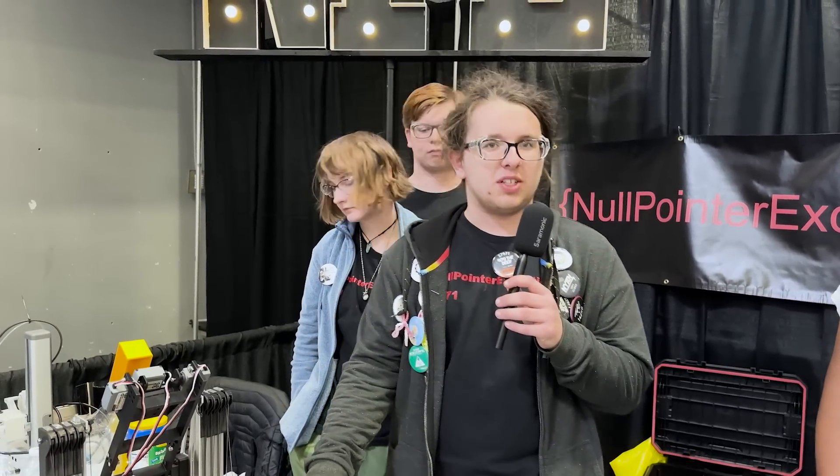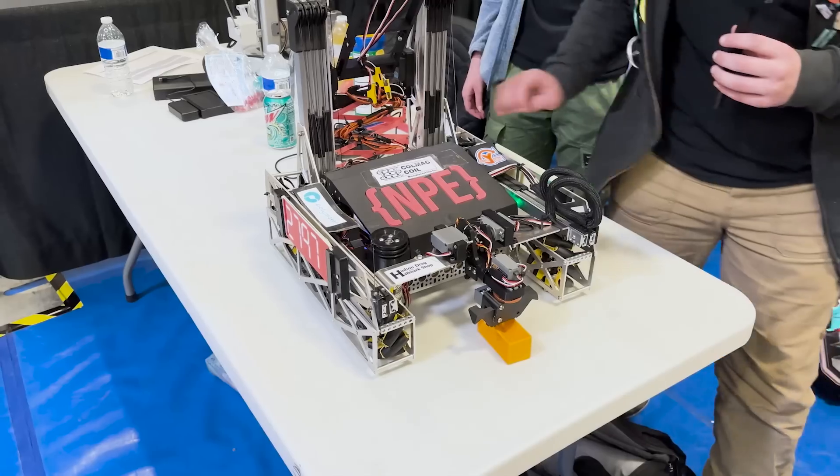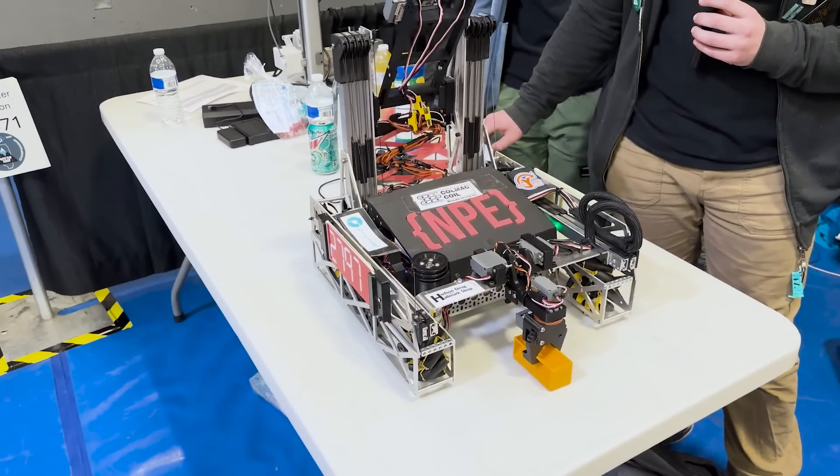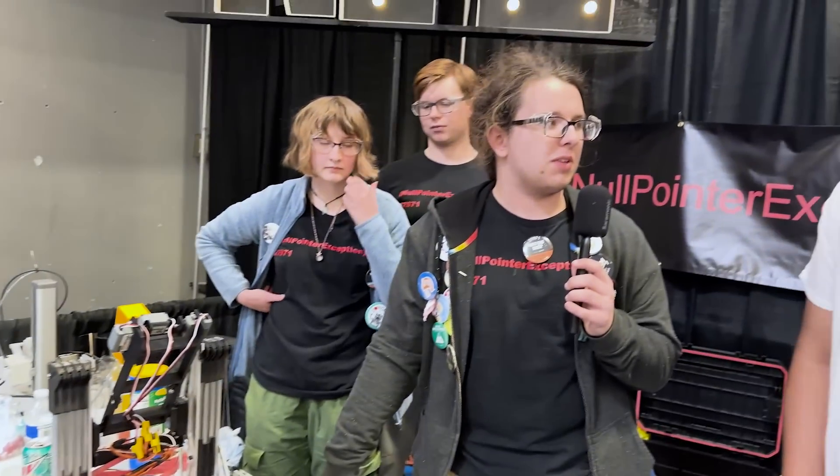Talking more about your outtake — how did you decide on two super-speed servos on each end as opposed to one torque servo? We originally did have torque servos, but they were really slow and we had to wait for them to move during transfer. So we switched to speed servos and got our transfer down to about half a second — you just saw it — which is way faster than we had with the torque servos.